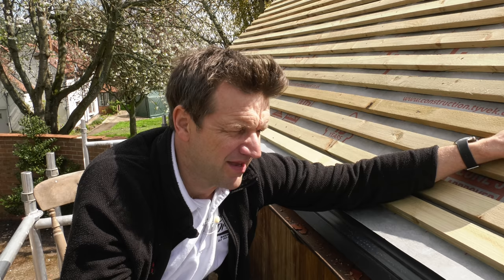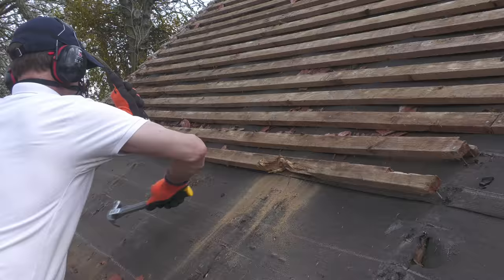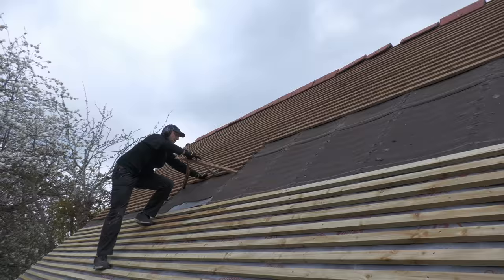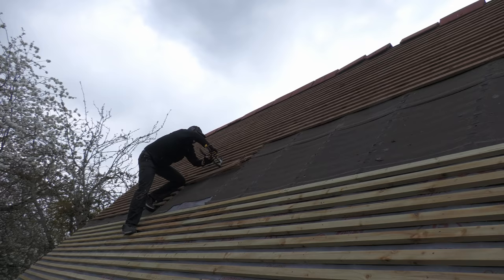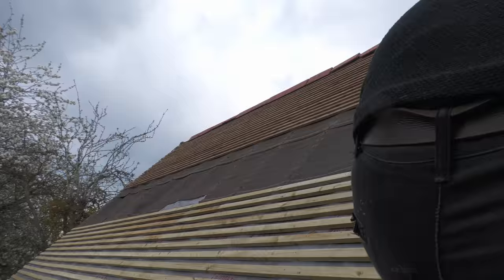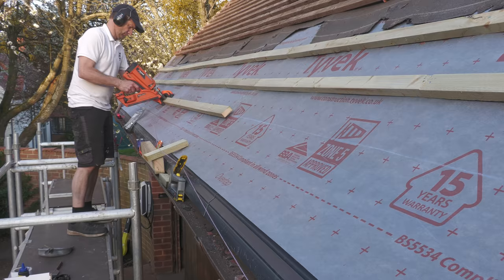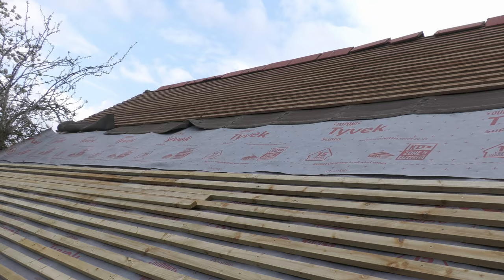This week I made quite a few mistakes. The first was trying to remove one batten at a time across the roof — it's difficult treading your way across. Much better to remove four or five battens at once, gradually working across until they're all loose and you can rip them off in one go. Similarly, fixing each batten individually slowed me down; it's much better to take four or five up in one go and fix them all into position at the same time.